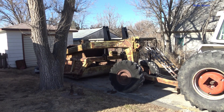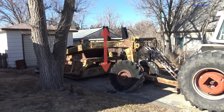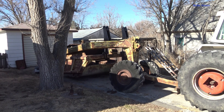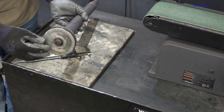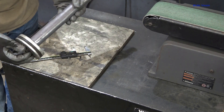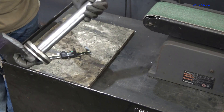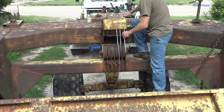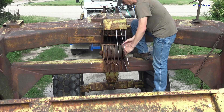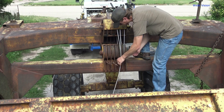Then I had to determine the cylinder orientation — would the cylinders be pushing or pulling the load? Due to space constraints, they are mounted in the direction of pulling or retracting. It would just be infeasible to flip them around and make huge mounts to allow them to extend to lift. Hydraulic cylinders have slightly less pull force than push force, due to the chrome rod taking up space on the piston. In other words, the area of the rod needs to be subtracted from the area of the piston when figuring out the retraction force. All this means the cylinders need to be big enough that the pulling force is enough to lift the huge amount of dirt and the weight of the bowl. Since there are two lift cylinders, I need to find a cylinder that can pull about 20,000 pounds.